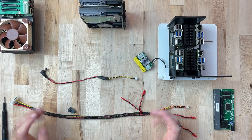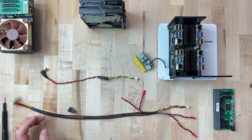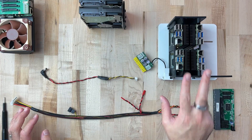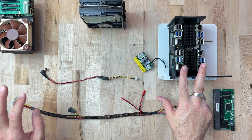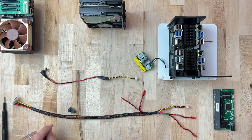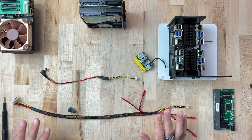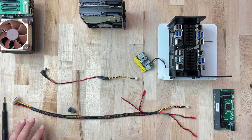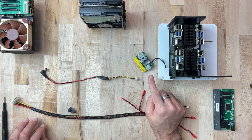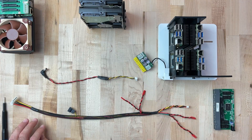We're doing a few things different here that we might not ordinarily do. We're going to be powering these nodes directly off their 5 volt voltage-in rail. Now remember, that's unprotected — there is no voltage regulator or anything; it's going straight into the chipset. So it's super important that you're using a power supply that provides a true 5 volt regulated, clean power.